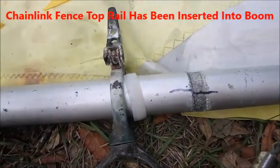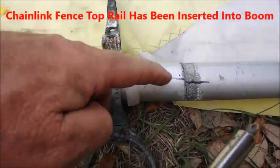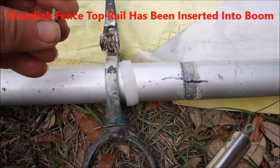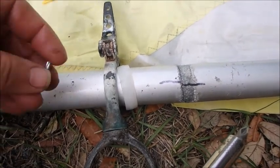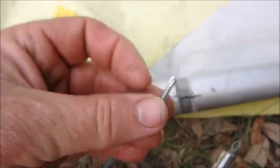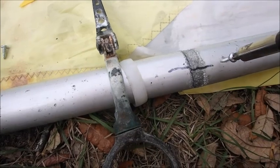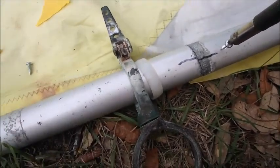You can see how we've lined up our Sharpie mark so the break is exactly matched up — the teeth and all the pulleys will be aligned. I'm going to take a self-tapping screw, which has a little drill bit on the end, and drill it right through both surfaces to lock this whole thing together.